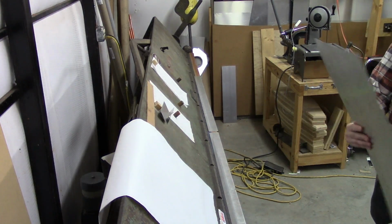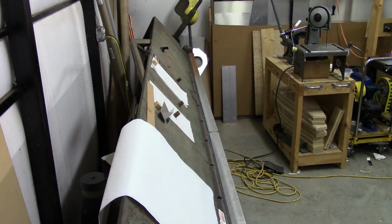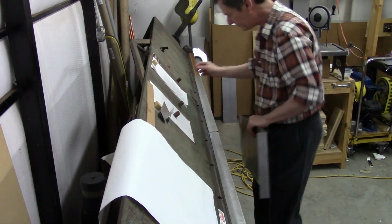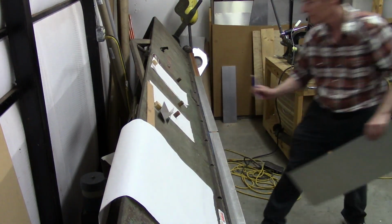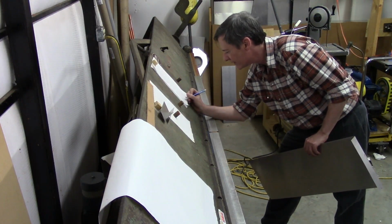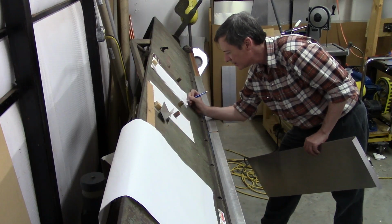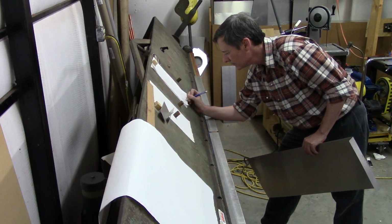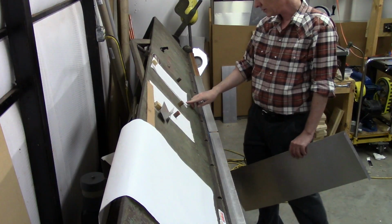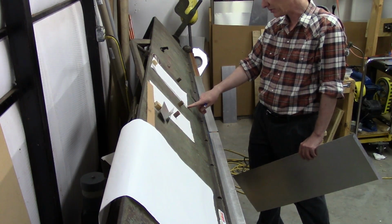Okay, so for the next part, we've got the middle bend here. And that one is also a 90-degree bend. So we'll make a note here, 016. Let's see, we did 72.5 and we had 86 degrees closed. So since we went about 4 degrees over, I think I'm going to probably stop around, say, 75 degrees on this next one.